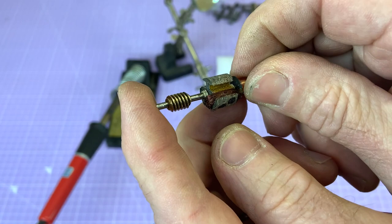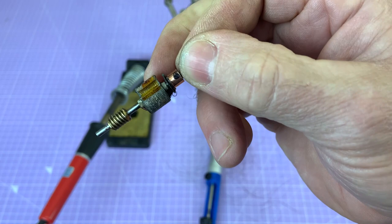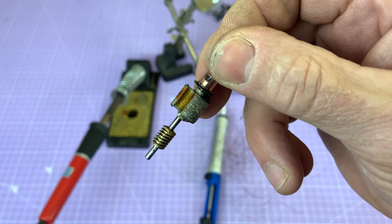Now, I've got some wire, just need to take some measurements. So it could be that I'll hand wind one of the formers and just see how it looks, how it behaves resistance-wise, and see whether it looks tidy. I tell you what, this wire is on tight. The machine that wound this put the winds on with quite a bit of tension. There's no slack in there, so it's going to be really important to try and get these tight.